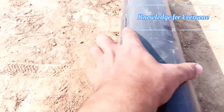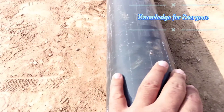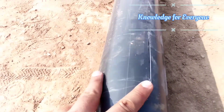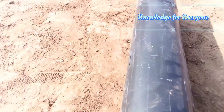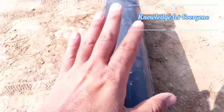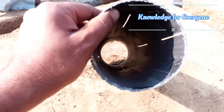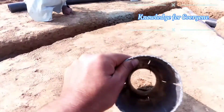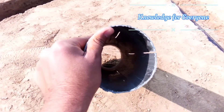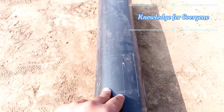So placed like this: one slot here, one slot here, and one slot here, slightly at an angle. The base is solid with no slot on top. Be careful — if you put any slot on top, it will act like a venturi and suck all the media, which can be sand, from the surface.